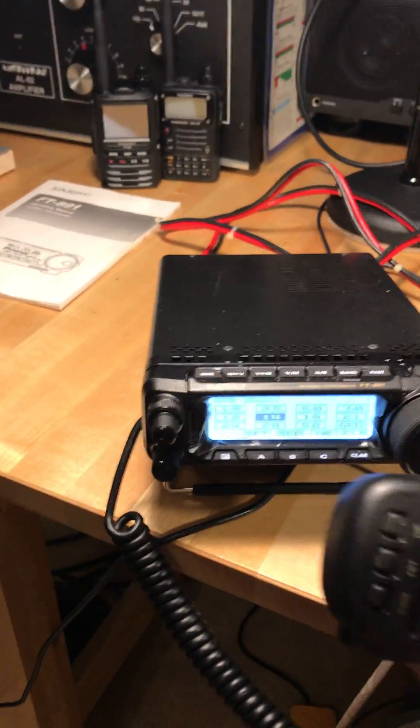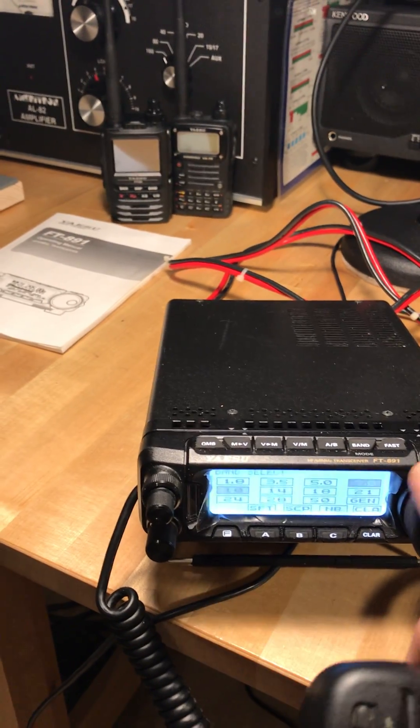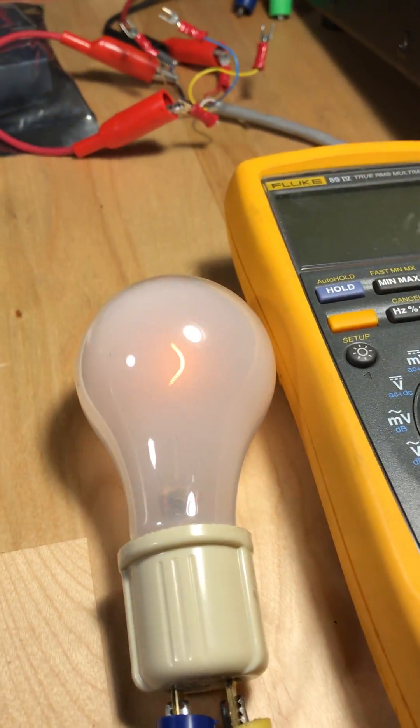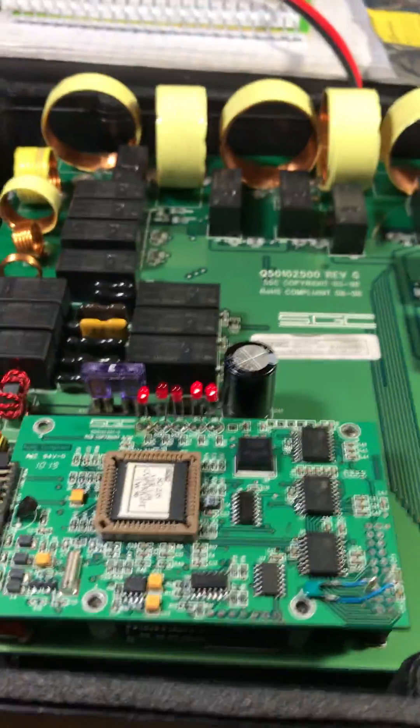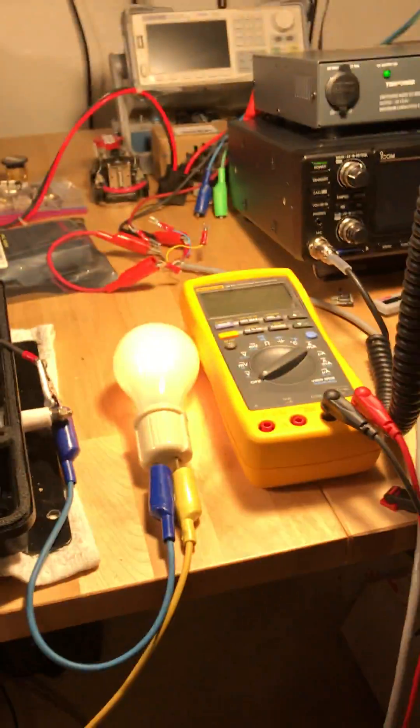On many other bands I don't get such a good tune, but it's on a light bulb so you can't really expect a whole lot. That's the way it works here. It's W2, it's trying — and this time it actually did. It found a one-to-one match. SWR goes to nothing. So there you go. I'm a happy camper.